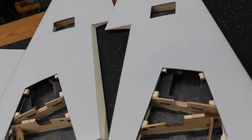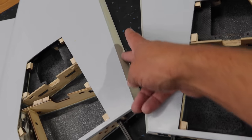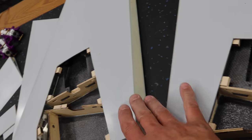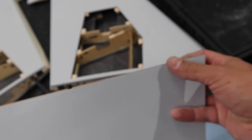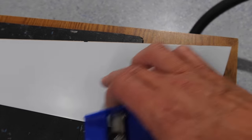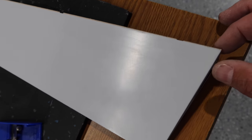Progress update: our wing flap trailing edges are now sanded — you can see the green hue from the filler. Those are all ready to go. The flap surfaces are also all sanded and ready. What I ended up using to remove the excess material was a razor plane, which works really well because it doesn't stick into the primed surface. The primer is nice and hard, so the plane rolls over it beautifully, trimming off the excess ply on the edge perfectly.